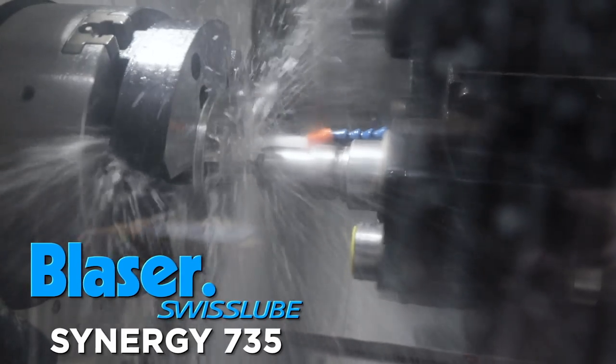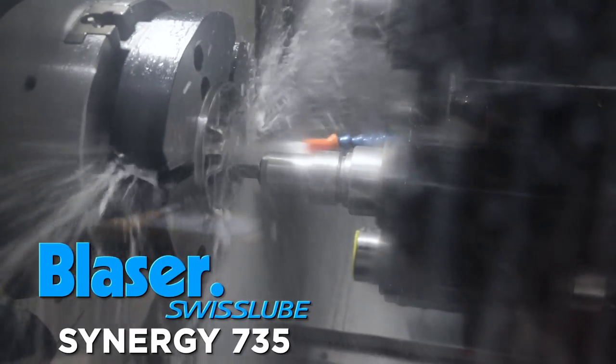There are also other tools — there are a lot of variables in manufacturing. You've got the spindle, you've got the turret, you've got the holders — everything needs to be absolutely rigid. And you also have the coolant, the liquid tool. We're using the Synergy 735 Flare coolant cutting Inconel.